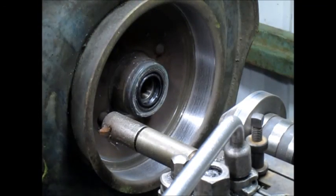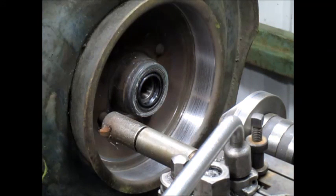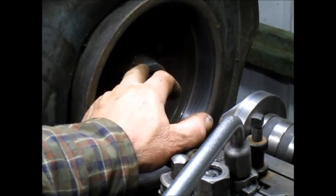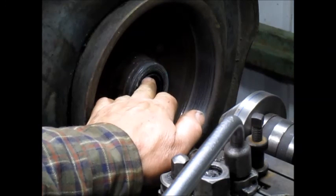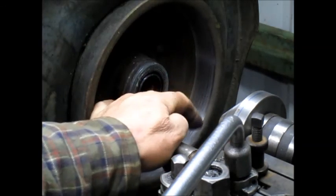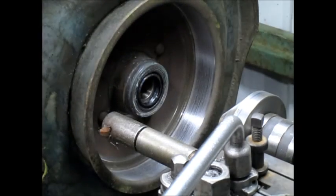All right, we'll take this one off and put the next one on. I might actually go back to the first one and take a measurement from this center hub here, because this is really where our centering is. You've got to get centered to that shaft, or else you end up with lumpy brakes. Now, probably that's the least of their worries. But, from my point of view, I want to make it as good a job as I possibly can. And this one was a stretch.